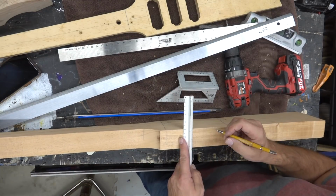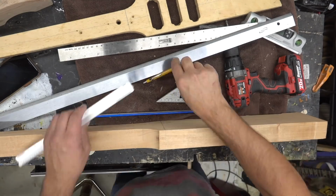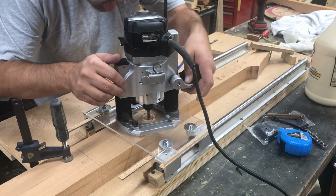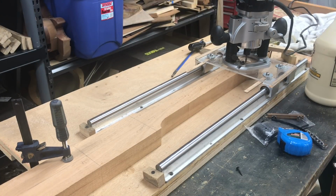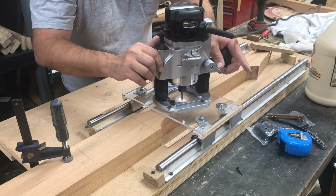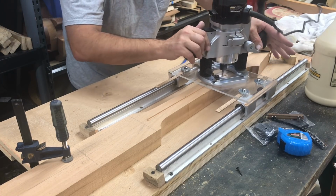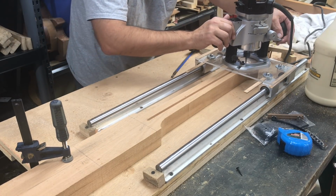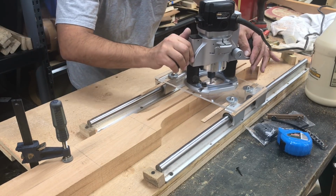So we're going to put our truss rod in here and do some maple strips to reinforce the neck. Usually when you're using a piece of wood this big, you want to add some reinforcements to it. Sometimes I use carbon fiber, sometimes I use maple. Today I'm going to use some maple strips along with the truss rod. This neck will not move then. Even when I did the initial setup, did not need to adjust the truss rod.